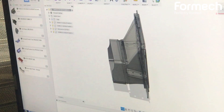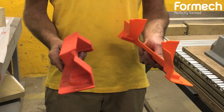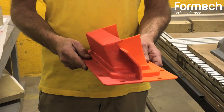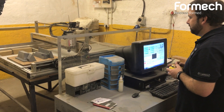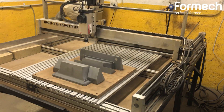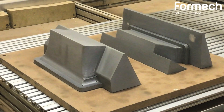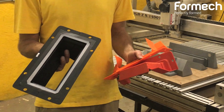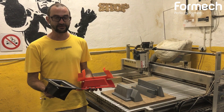Once the CAD work is done, what we used to do in the past is 3D print the parts and then make silicone molds of them and cast them in polyurethane resin. For the second run we thought we'd rather machine molds — vacuum-form molds — which produce a much better quality part with a lot less labor and material cost.